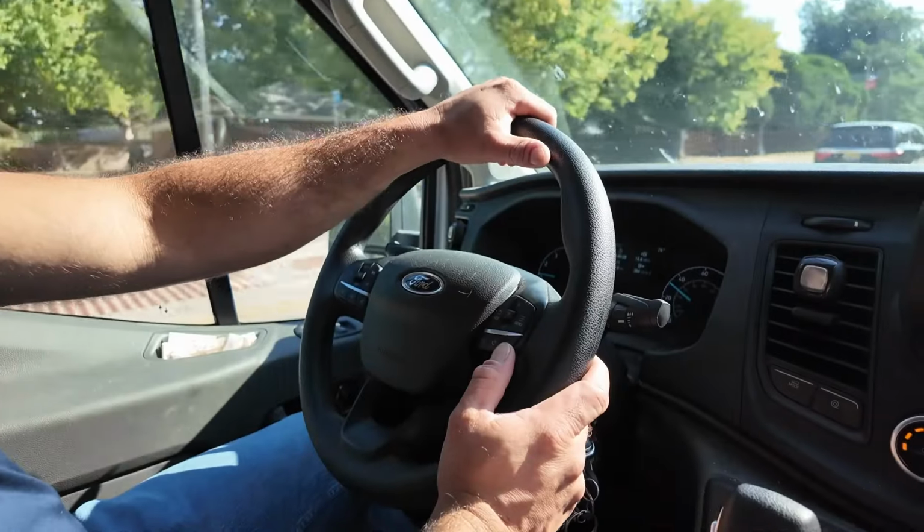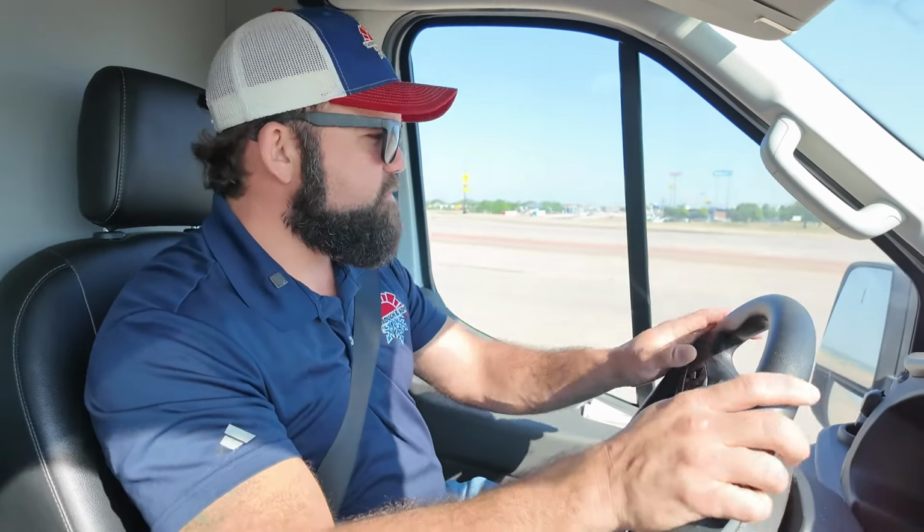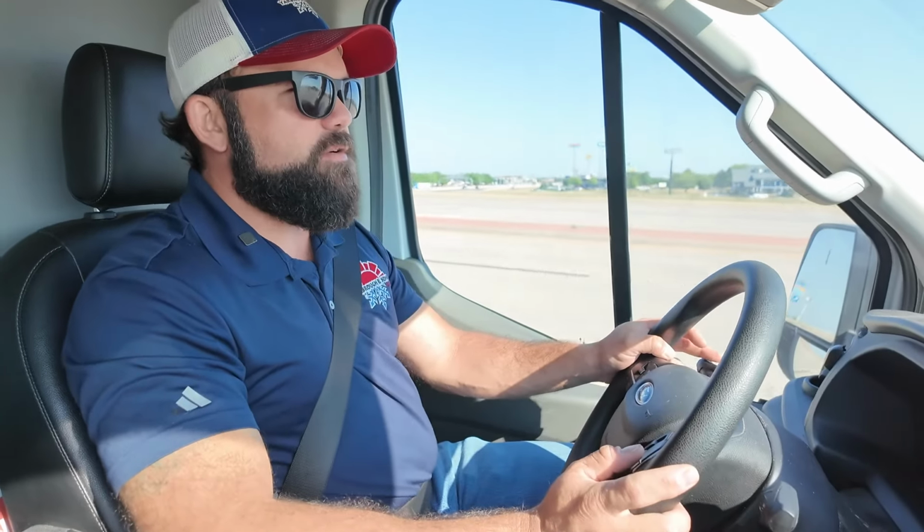I don't know anything about this system, but the homeowner seems to think that they may have an undersized return just due to hot spots in the house. Based on most of the houses we see in central Oklahoma, I would say their assumption is probably right. So we'll look at that, see if there's potential to add another return, or even if that's the issue at all, because we don't want to run on assumptions by any means.